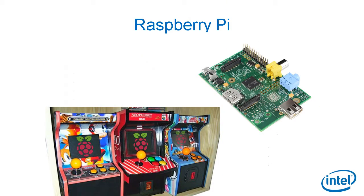And we have the Raspberry Pi. This board was designed as a small and cheap PC. It's not great as a PC, but as a small embedded prototyping platform it's very popular. It's using an ARM processor, not Intel, so you can install Linux and program it with the language of your choice. Like Arduino, there are pins you can access, but you have a limited set of I/O available, missing important things like analog inputs. It's not for total beginners, but it's very popular with Linux developers interested in small embedded projects at home.